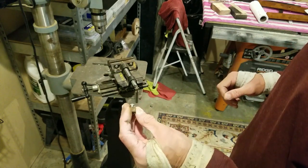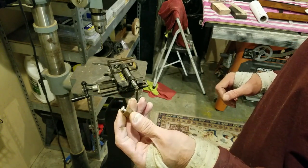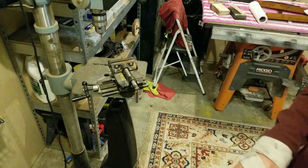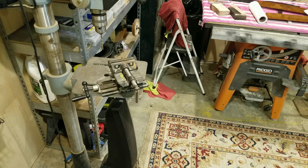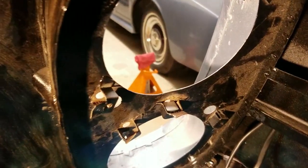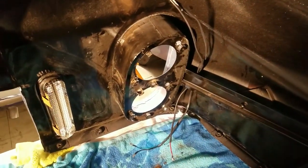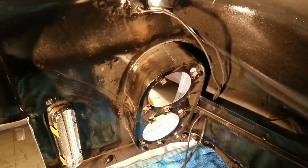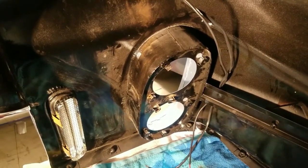By the way, when you bend the tabs back, if they've got something like this in there, you can drill them out in the frame sometimes. But it's a lot easier if you take these blocks out and use them on the big heavy tools outside. I broke several off on the car - that's just an example of drilling one out. You might have been wondering as I tap those little squares out there where they went - they go right in there. You drop them in that slot and they're encapsulated there. You can bend that out with a screwdriver and then simply take a pair of pliers and bend it back down. That's a lot easier on those encapsulated nuts if you can get to them.